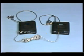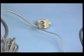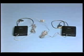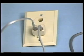If you connect two bus drivers directly with the wire included with each bus driver, only a single reversal would occur and the system would not work. To test a two-station intercom in the absence of installed wiring, use either non-reversing cable or connect the supplied wires from each bus driver into an ordinary one-to-two telephone splitter. Never place a telephone splitter into a bus driver — only into a wall jack or leave it hanging. Used as a double jack, it can connect two bus drivers.